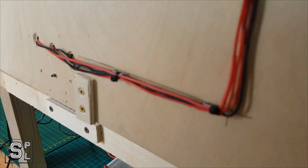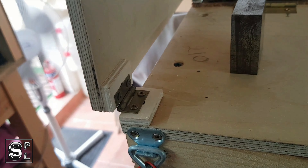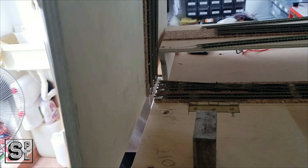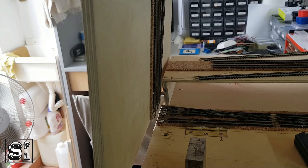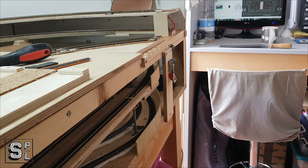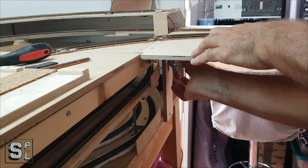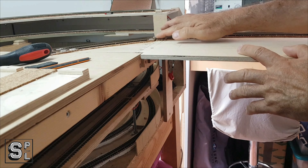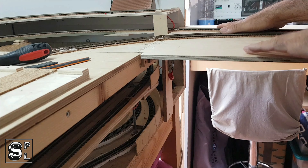These go down here and feed the track respectively. No rocket science — simple hinges. I have to raise the hinge because otherwise the tracks will hit. I'm going to lock this in place — I'll remove the latch, lower the section down, gently guide it into place, and fasten the latch. Over here I just double check that everything is okay and it's nice and smooth — right in its place where it should be.